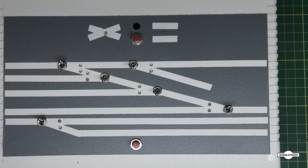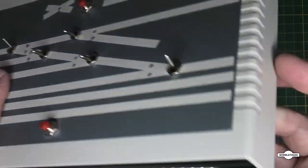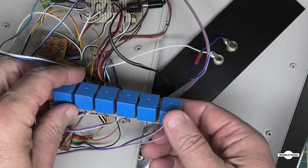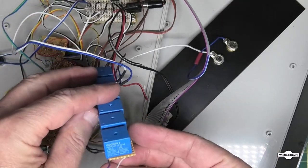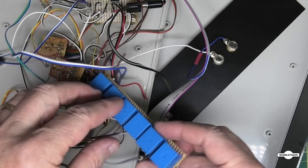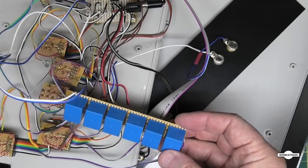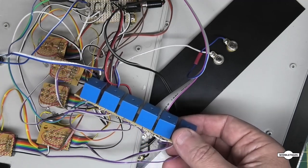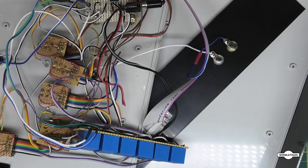Here's an early control panel I did — I think it had six turnouts on it. I'll show you the relays inside; it's a bit of a mess wiring-wise. These relays are probably a bit overkill; you probably don't need ones this big, so you can just pick up the cheaper ones on eBay. For this one I ran a 3 amp 12 volt power supply to make sure everything worked — I tried a 1 amp and it wasn't enough, depending on whether you're switching them all at once.